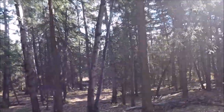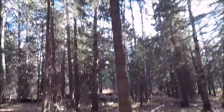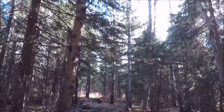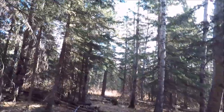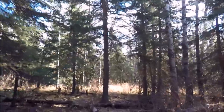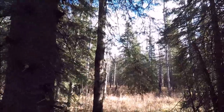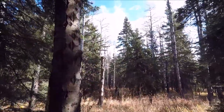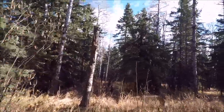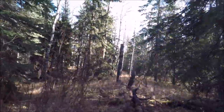There's fairly large timber in here — a mixture of spruce, poplar, birch, and pine. It's fairly old growth; it's never been farmed. The surrounding area has been fully farmed, but this area has never been cleared. Continuing down toward the termination, you can see there's been a lot of maintenance clearing branches off these trees. Generally the wire is straight, though it zigzags a little. It's predominantly straight at about 10 feet high — nominally 8 feet — and I used a stepladder to go up each tree and attach the insulator.